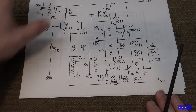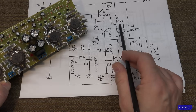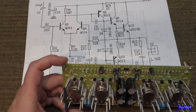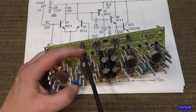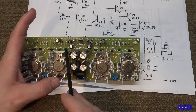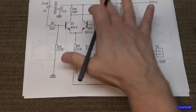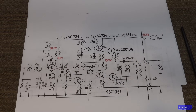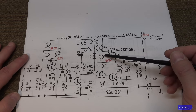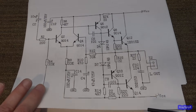In a nutshell, that's the amplifier you have right here. You have your outputs, your two drivers — Q8 and Q10 over here — and your Q6 and Q2. Then you have your feedback transistor Q4. You've just split this in half; you have two identical channels on there, and that's your stereo amplifier. Now let's look at a commercially built amplifier that's similar but not the same. This one is an older Pioneer — I believe it's an SX535 or SX525. It's similar power and performance to the one we're working on.